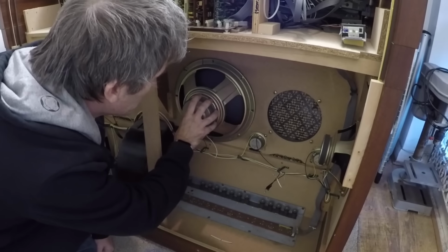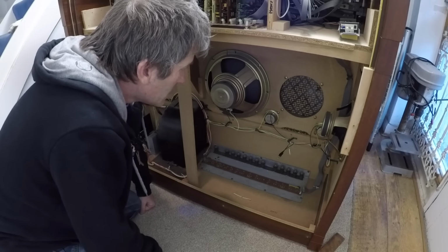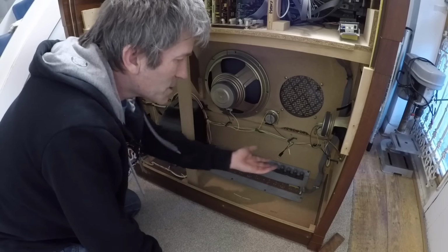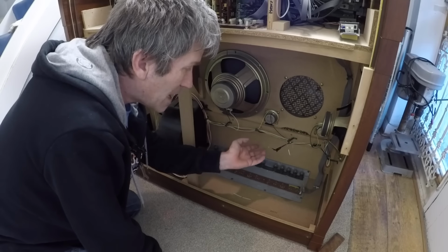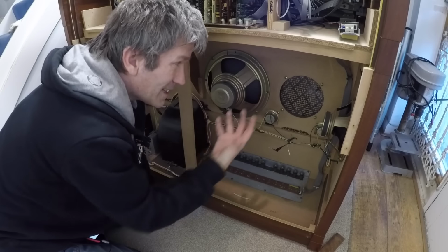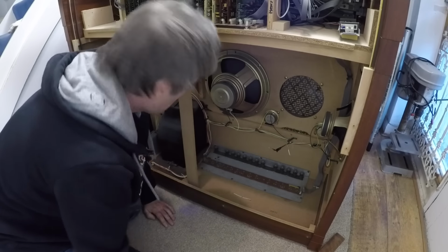Although you'd think it would be the big woofer type speaker that would be for the bass pedals, because it works through the headphones, like I say. That'd be nice. That'd be a nice easy fix. Unless there's a problem on the amplifier and that channel is actually dead. I don't know, but there's no harm in trying. It just seems a bit peculiar that these two wires are hanging about and there's no speaker, and yet I've looked into this and didn't even see the obvious that there's a speaker missing. So let me spin this around and attach a speaker to that.